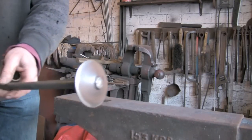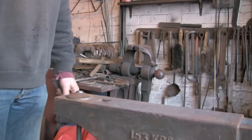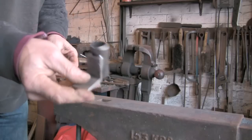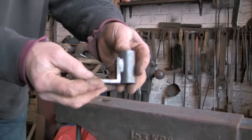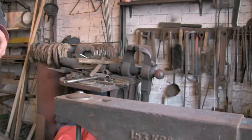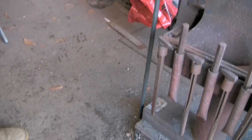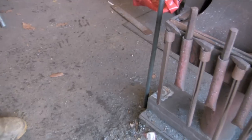All right, so I've welded up the mushroom — that's going to drop in there, fairly square. I'll tap these bits together; it doesn't need to be a tight fit, it's only a guide so it doesn't need to be fully welded. And that is going to be welded down here — you can see where I've ground the base of the anvil.